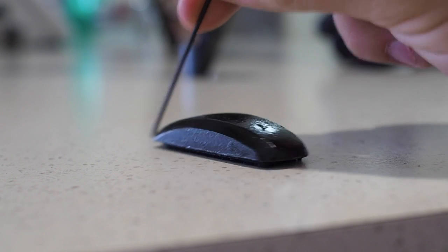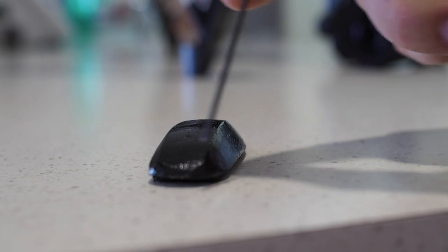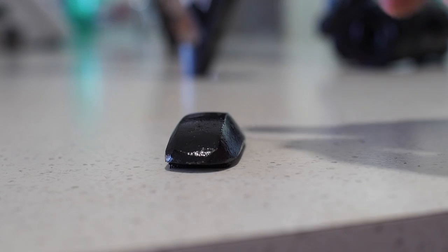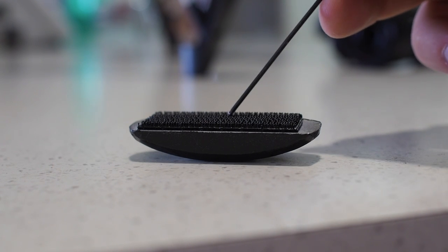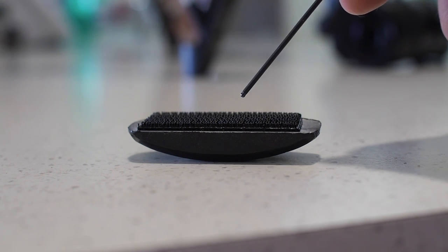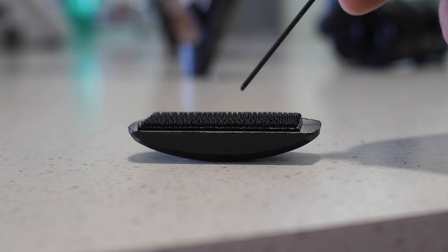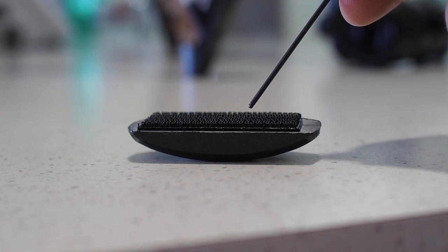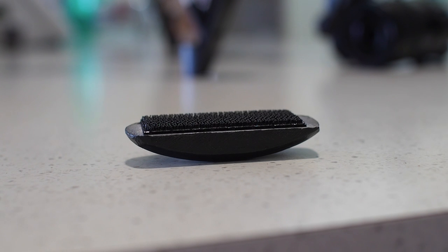That on its own still isn't finished — I needed to add a chamfer on one side and a large chamfer on the other side to clear parts of the gimbal, and also take a little bit off the front and back to make sure it could swing through clearly. In my last video I was using 3M dual lock to attach the weight, but dual lock is just too thick — together the two pieces end up being about three millimeters and that's too much. So I've used another 3M product — it's like a removable photo frame hanging velcro. It's similar to dual lock, just not quite as thick or as strong, but it doesn't have to be. I'll put up the details in the description.